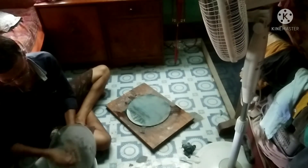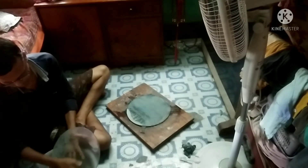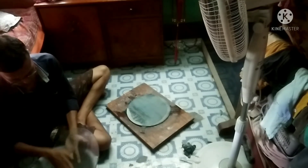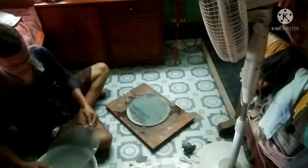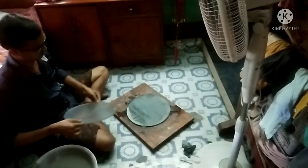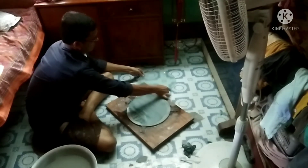After another one hour of grinding with 220 grit, I checked the transparency of the mirror and noticed that the transparency has increased. So here is the end of my rough grinding process and I will go to the next fine grinding process with 320 grit. Thanks for watching and subscribe to my channel to watch the full process of telescope making.